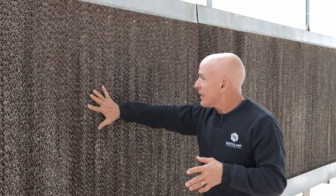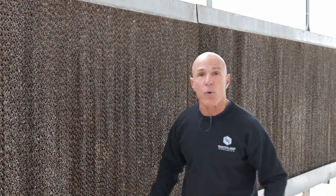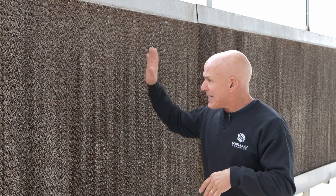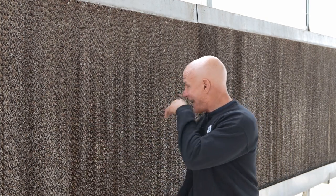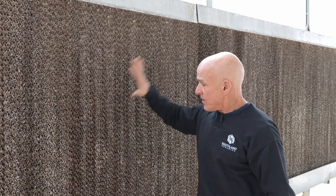Two things you've got to keep clean with cool cells. Number one, make sure they are actually clean — no buildup. It's been since last fall since you did this. Are there cobwebs? Is there anything going to restrict the flow? You've got to clean these: get mineral deposits off, get the bacteria off, keep those cool cells clean. You can pressure wash them, but when you pressure wash, these are at an angle, so you want to shoot at an angle with the cool cells. Keep them moving in the same angle.